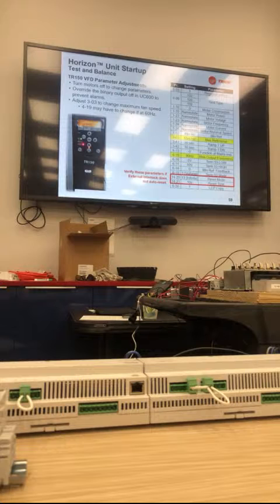Yeah, they're infinite. It is worth noting that those two parameters are not a risk to the equipment or any of the safety or anything like that. It just switches it from manual reset to auto reset whenever the unit goes into alarm. So our e-stop is auto reset, but if the unit goes into e-stop and these parameters aren't set, then the VFD is actually manual reset, so they'll have to come up and reset the unit. So it's not as if the equipment's going to become damaged, it's just manual instead of auto. Basically, if they cycle power, it's not going to run. If you don't change these parameters, or if you have a smoke detector or anything, it won't come back on at all.